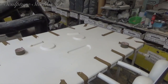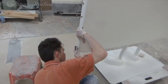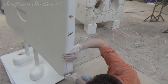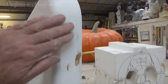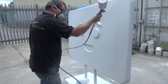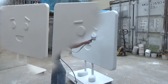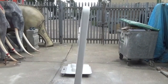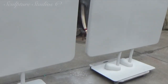The laborious task of cleaning up now takes place. The squidge join on the inside of the job saves on having to clean up any exterior fiberglass lamination, but we still need to clean up any excess resin and the car body filler that we're going on with to make up the join. When we're happy with the finish, we go on with a final primer layer to prepare this for artworking. Following the reference the client sent us, Aden begins to blend the dark blue, the light blue, and the aqua turquoise colours, going over with each pass and building up in layers. This needs to blend softly, but still be as bright and vivid as the concept character. Though we have to get this as close as possible to the reference, the main thing is, each of our sculptures is identical to one another.